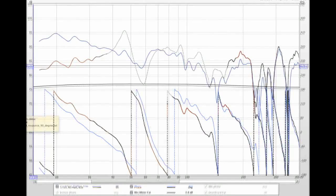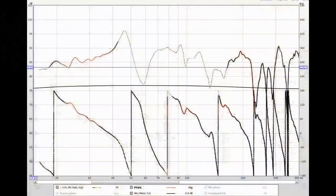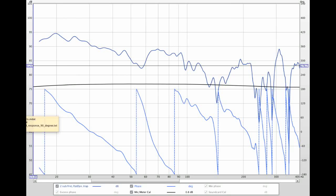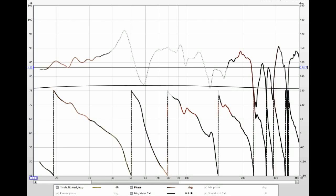He's got this issue up at 120 to 150 Hz that's there before and after. It's a little more complex because your speakers are playing in that range too. Looking at the labels, it seems as though that's only a measurement of his subwoofers. One thing to realize is that up around 120 to 150 Hz, they should be quieter anyway, because they're already within the crossover region. Up at 160 Hz, they should be 24 decibels quieter than they are at 80 Hz — that's what your crossover is supposed to do, what the low-pass filter is doing. However, what he's showing in the graphs looks more egregious than just being down 24 dB in that range, and it's happening a little lower as well. In any of the graphs, you can see a dip roughly halfway between 100 Hz and 200 Hz — it's consistently there. So that seems to just be part of the response of his subwoofers, with the extra dip on top of the expected 24 dB rolloff.